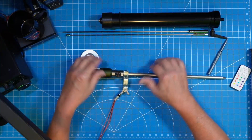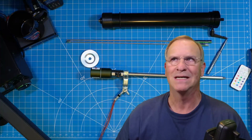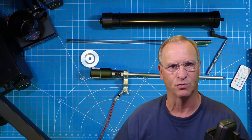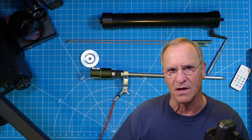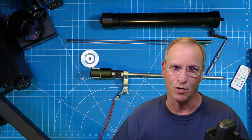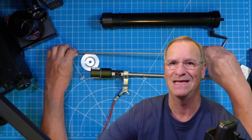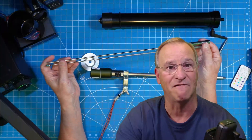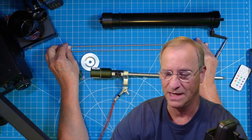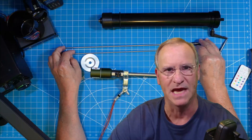We're going to set up this stinger and operate on 20 meters. 20 meters is what we'll use because I'm using a coil antenna — so it's mono-banded. I'm going to dial it in somewhere in 20 meters where my SWR is good across a broad swath of the spectrum, then operate all up and down 20 meters: single sideband, FT8, and WSPR. Most of my videos take days, weeks, sometimes months to complete. While working on this video, Gable reached out and offered a discount — check the description below. This antenna system from Gable Radio is very high quality and durable; I'm adapting it specifically to the HOA going stealth.